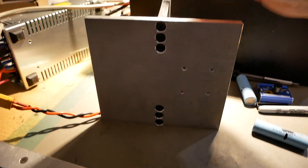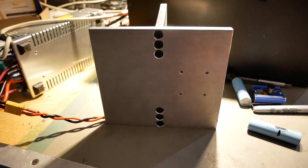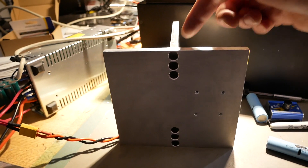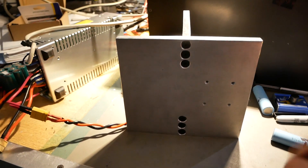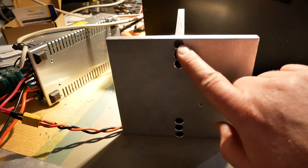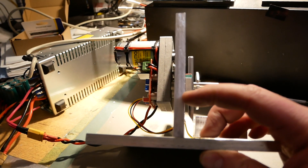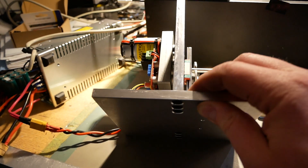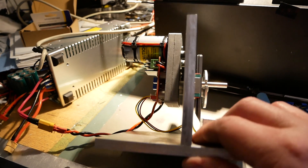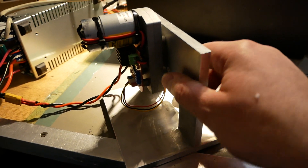The whole thing is half-inch aluminum — overkill. The one in the video had little angle brackets and I think his base was wood, whereas mine's all aluminum, so mine's going to outlast his. I've got six M5 screws threaded up into this aluminum, so there are lots and lots of threads — this probably is never going to come apart unless I take it apart.